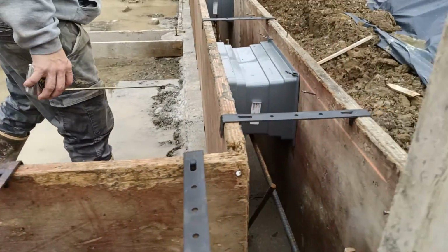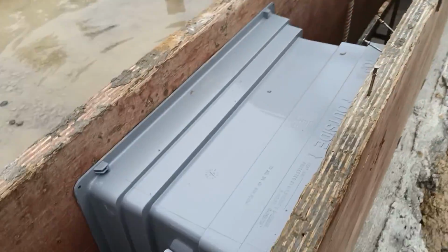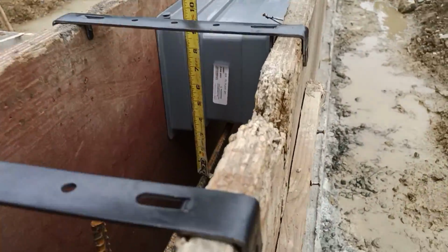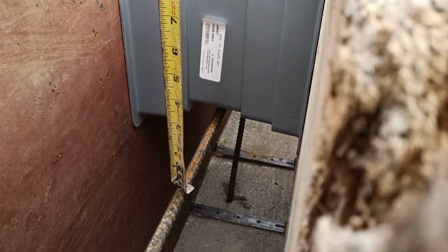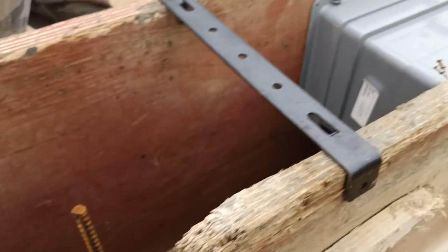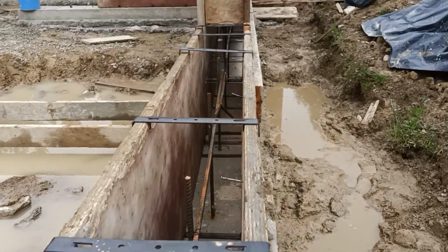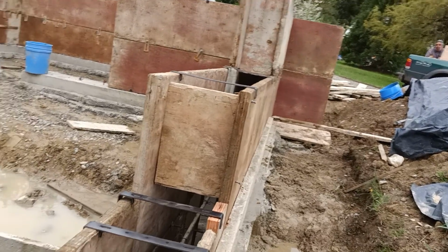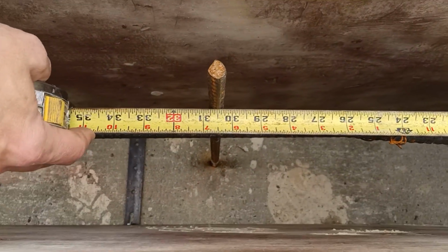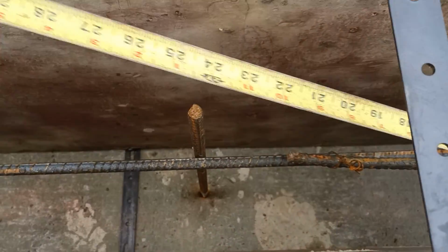And carry through. We will now be coming around the left side of the house. So another foundation vent. You can see also our ventilation. You know, we keep the steel 1.5 inches away from foundation vent, 12 inches from grade. All 2 foot. Just the 1 bar. Here we'll step multiple elevations, 1 more foot and 2 more foot. Here we'll show another splice within our 2 foot coverage.